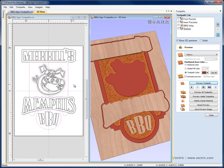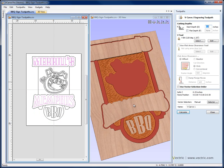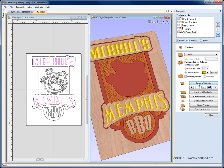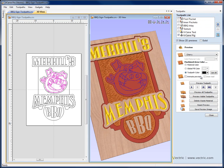Next I'm going to do some v-carving. I'll select the two lots of text, close the preview, come to the v-carve toolpath. This is on the face of the material so start depth is 0. I'm using a 120 degree v-bit tool. I'll call this 'v-carve text' and hit calculate, then assign it a gold colour as if it were being gold leafed. Next I'll select the inner vectors for the pig and come back to v-carving. This time the area has already been cut down, so I need a start depth of 0.25 — it's been machined down a quarter of an inch. Same 120 degree v-bit. I'll call this 'v-carve pig', calculate, and assign a dark green colour.